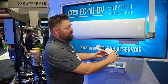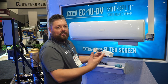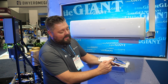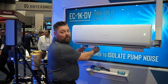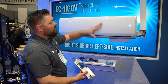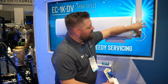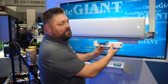One important detail is eliminating vibration, because vibration from the pump turning on would actually make it louder. A simple solution is these little grommets that allow the unit to sit up against the wall without creating any vibration. This is the next step in our EC1 category — same pump, and we also have our line set cover. We've had that for years, and we've really seen in the market that this undermount version is the next step.